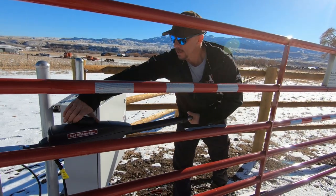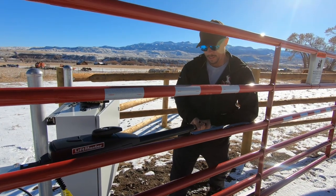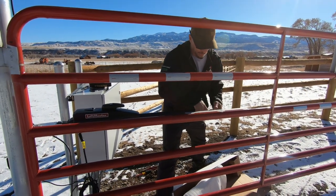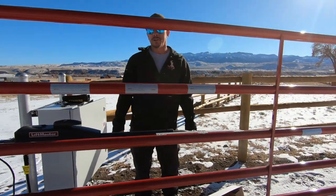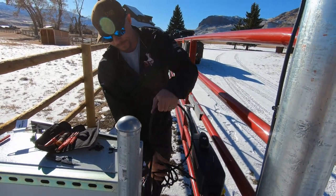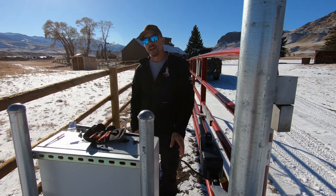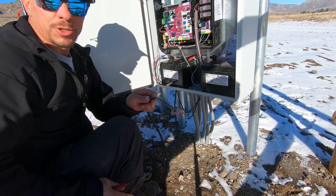This is what's supposed to happen — that's locked, but when I unlock it I should be able to freely pull this. That was not the case with the last one. So that's how you're able to open and close the gate manually if your installer didn't give you enough battery power or you have another problem.